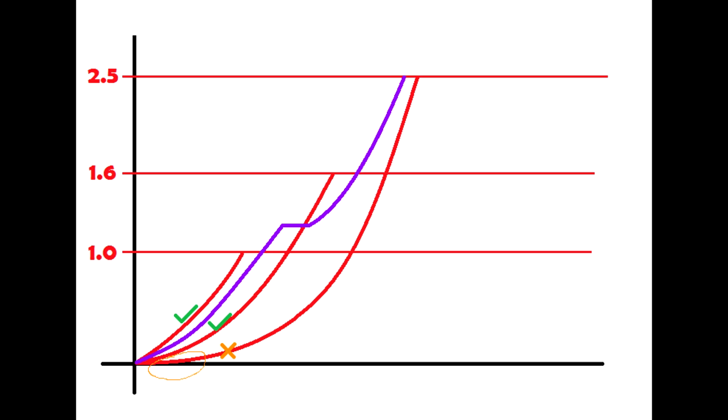That's a different subject later on in the video. For now, just the medium and full speed. You can't put it straight to full speed because you don't have the starting torque. So you put it in its medium speed, wait for it to speed up, then switch to the faster speed, and the faster frequency going around the motor is not having to slip the motor from a standing start, it's having to slip the motor from a medium speed.